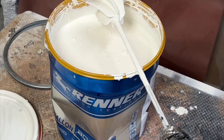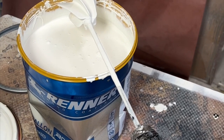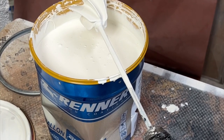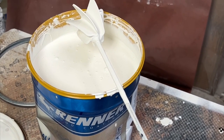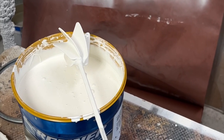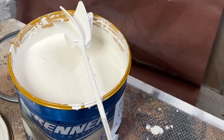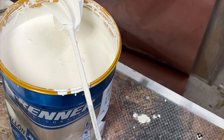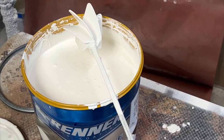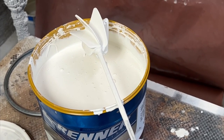I don't even spray my primer super heavy. I like to put a little bit of retardant in it to let it flow out, and it flows out really nice — almost like glass off the gun, with almost zero sanding needed. I just scuff them up a little bit between each coat but spend very little time sanding. I'm talking about doing new doors now. If you're doing old doors and trying to fill in imperfections you might spray a little heavier on your primer and spend more time sanding, but for new doors with a smooth substrate you're not trying to fill in imperfections.